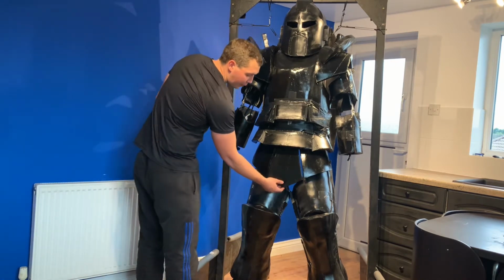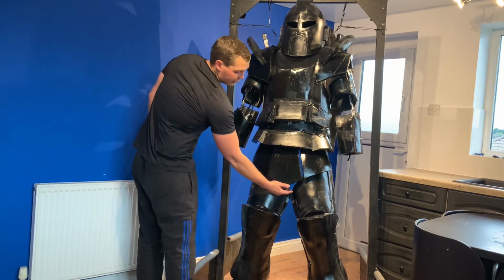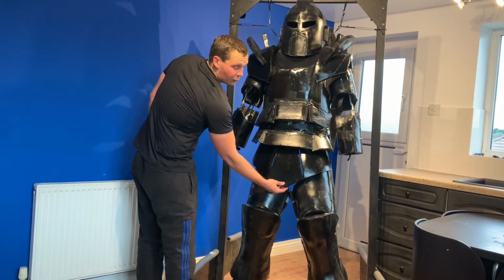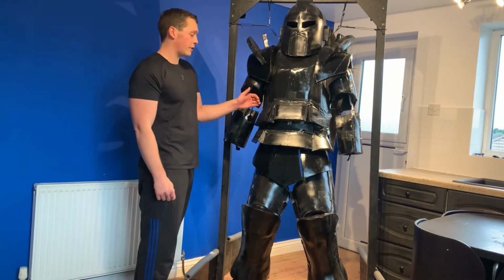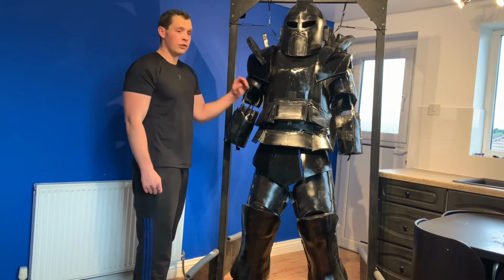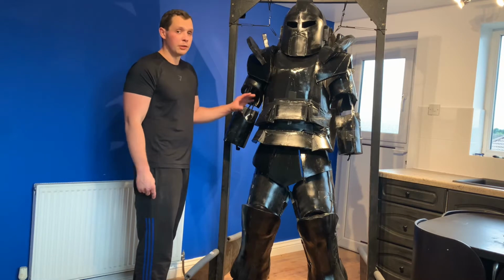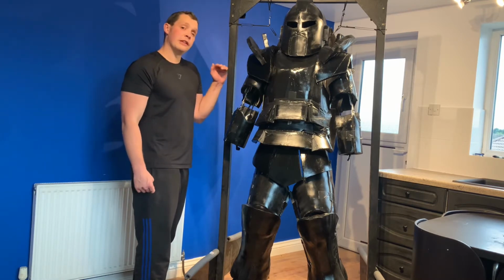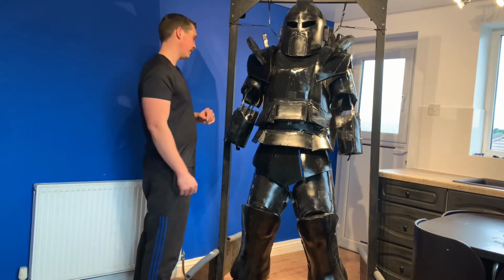This one perhaps might have a hinge that has some slack in it sideways to allow it to rotate sideways, which again will probably be with a Kevlar hinge. Another big reason I'm wanting to use these Kevlar hinges is because if you can use that and you're not having to bolt on metal hinges, you're simplifying the manufacturing process massively, simplifying any failure points, and from a logistics point of view, it means you've got less stuff to carry to repair it.